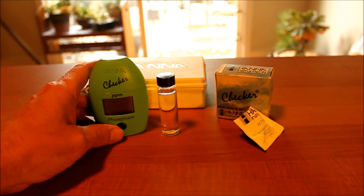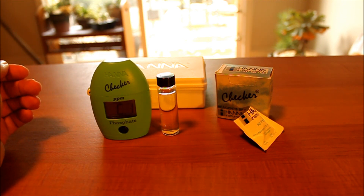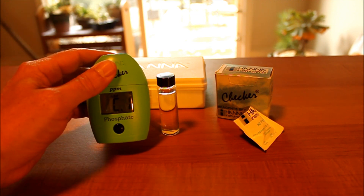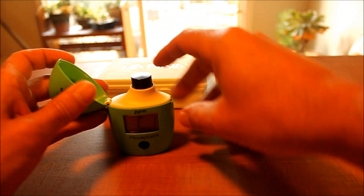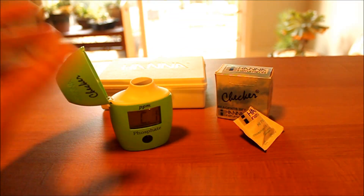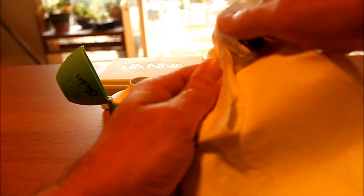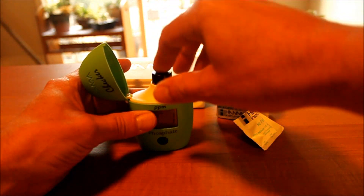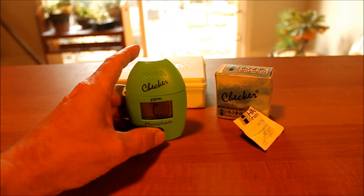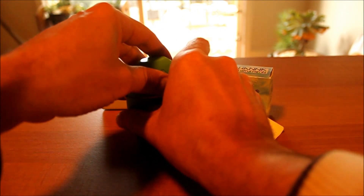First thing for the meter: do one click and you see that comes up C1, press, open it up, stick the vial with the water in. This is the calibration step. Make sure you don't have any fingerprints or anything on there. You want to try and eliminate air bubbles, anything like that in there that could affect the test. Put that in, quick press again, let it calibrate — okay, now that's calibrated.